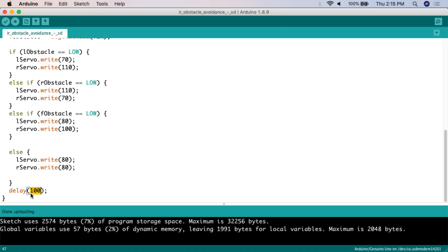The delay is something you may want to play with. If you run it too fast you may get quirky issues, but if you run it too slow — say 5,000 milliseconds, which is five seconds — it will do whatever it's doing for five full seconds before rechecking the sensors. Somewhere around 50 to 200 milliseconds is a good range to keep it looping quickly without causing problems.